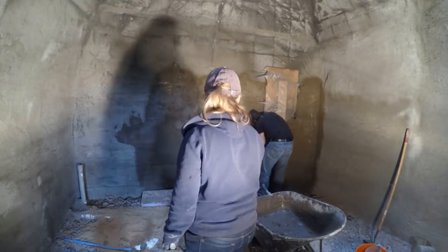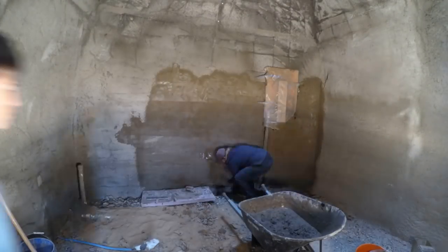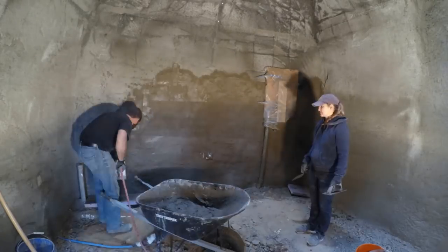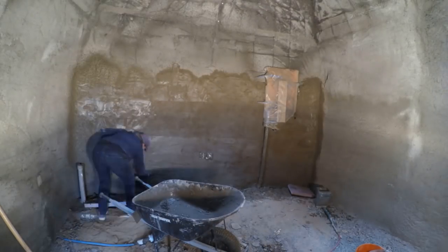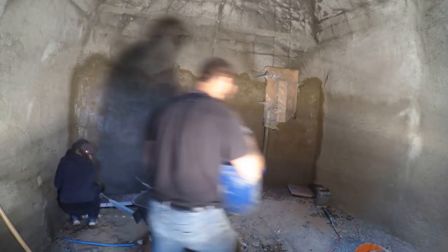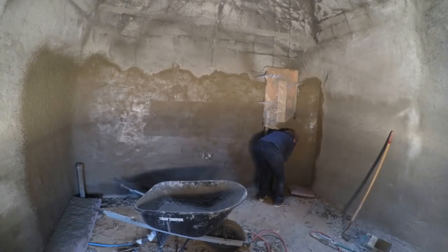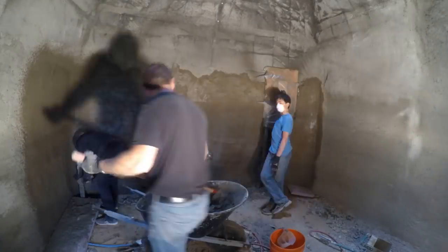We started with this mortar sprayer as we'd done in the basement. The walls were rough and we didn't think we could really get the stucco to stay up any other way. It works and you get the stucco up really quickly, but it's noisy with the compressor running and it's tiring, as you gotta hold that thing up. And even after it gets the mortar on the walls, you still have to go over it again with a trowel anyway to spread things out.